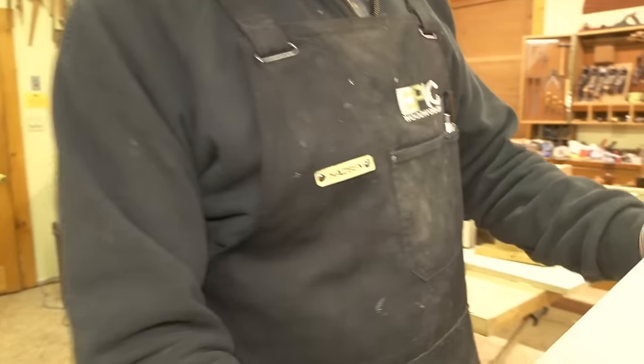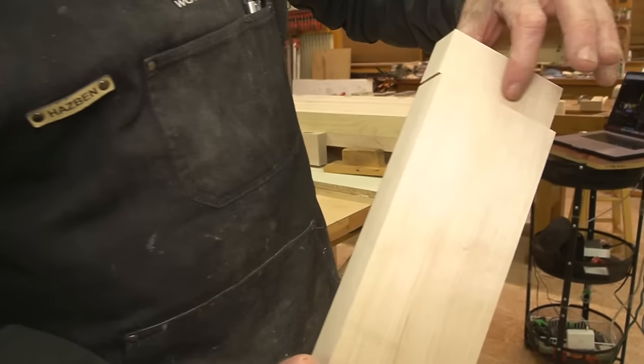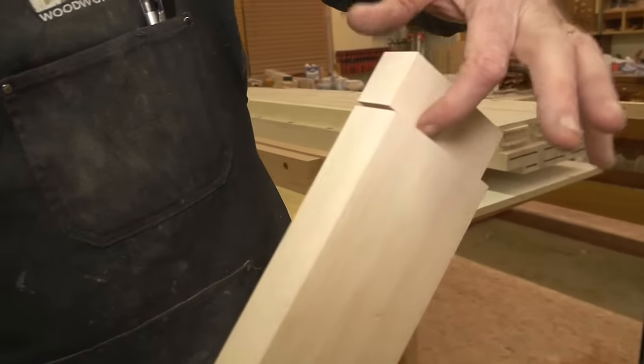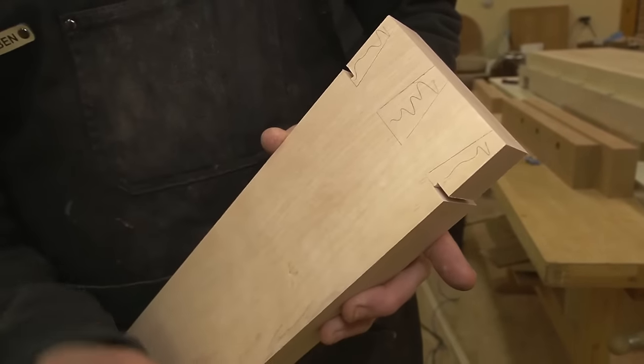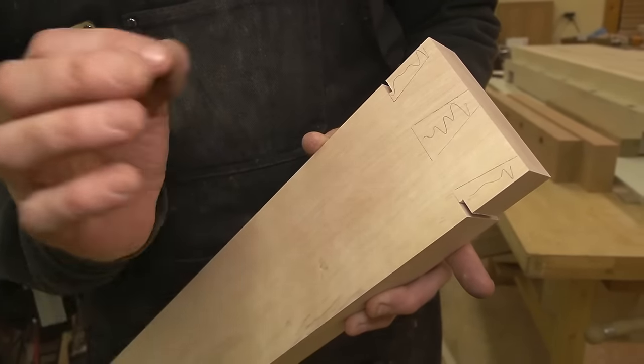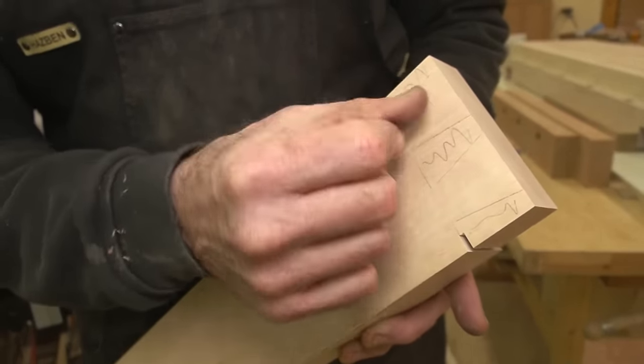You can see what we've got here. We've cut our ledge in the back — we'll clean that up after — and then we've got it squared around, so we've already got our shoulders created. Now we're going to use the other bandsaw with a little angle jig to make these tail cuts.